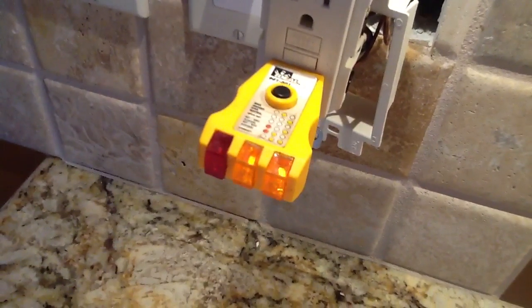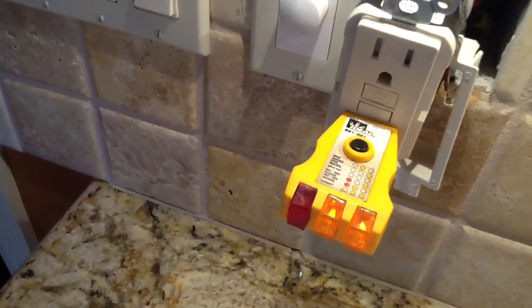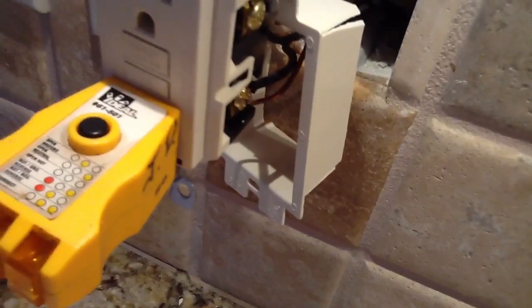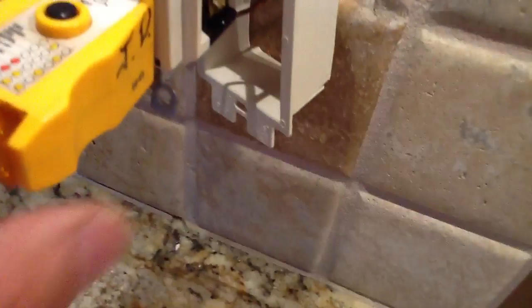The second thing we are going to talk about is the tripping mechanism, to make sure we have a minimum leakage going through the GFI circuit. So I am going to trip it out — watch the light. That means it's working. The GFI is wired correctly. If the thing fails to trip out, that means you are hot.